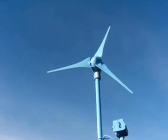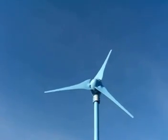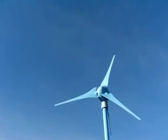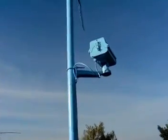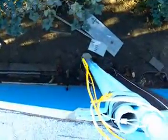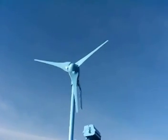This is our second ARX wind generator — also a 12-volt, 400-watt generator from AffordableSolar.com. It outputs about 400 watts or 28 amps in ideal conditions; we usually don't get that unless there's some sort of windstorm. I have this one mounted on the roof and it also has a webcam — we call it the wind cam. It's on a telescoping tube that goes all the way down to the ground into a cement base. It also has a six-gauge cable going up to it, and we need about 7 to 10 miles per hour wind to get it spinning.